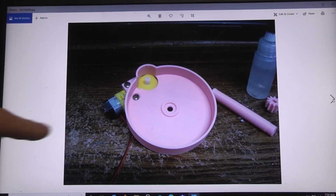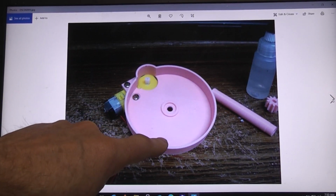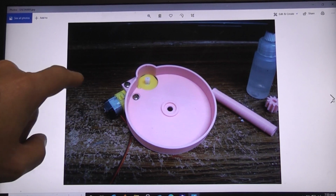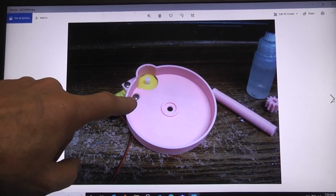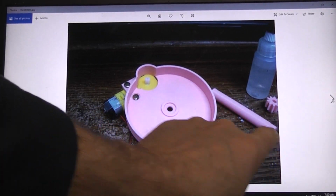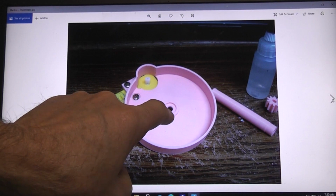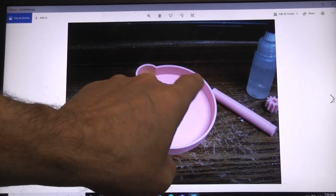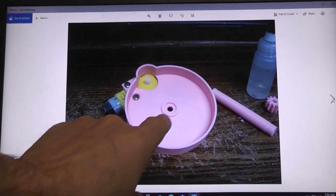So one of the first steps you'll do is you'll print this, which is basically the gearbox frame. And I'm using the 120:1, or as I like to call it in the ads, 1:120 gear motor, which is held on, in my case, with two 6-32 screws. It sticks through, it's one piece. This is a shaft that we have to glue down into that recessed straight and all the way down in there. There's a hole because the wires from the top dome light are going to pass all the way down through that shaft and then come out through the bottom.